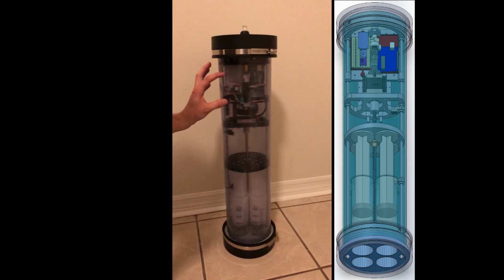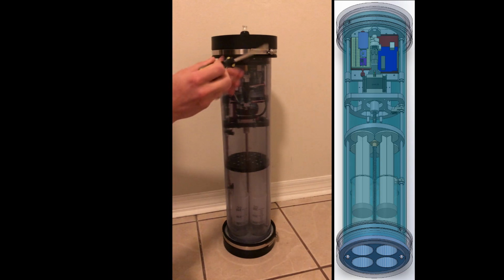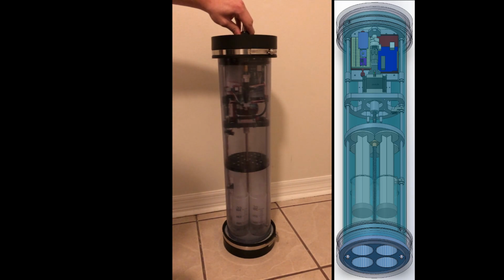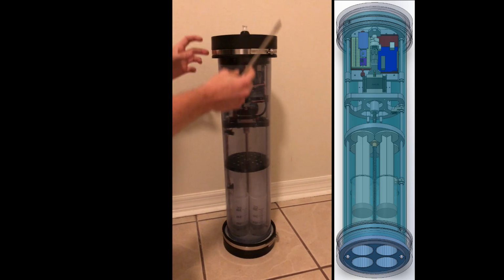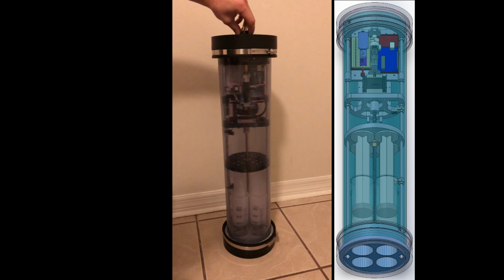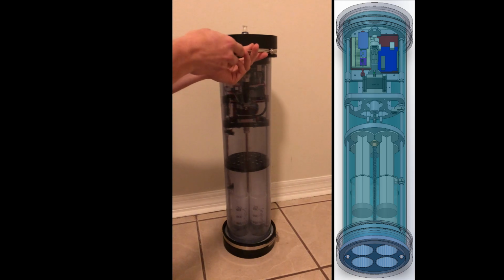And the pressure sensor, which has a tube on it that extrudes out the back and is sealed right here, is mounted on the inside carriage. So even if you loosen up this hose clamp and pull it up, if this NPT gland is still tight, you'll end up trying to rip the pressure sensor out of it. So first off, we're going to loosen the NPT gland cap, take that off, and from there loosen the back end cap hose clamp.